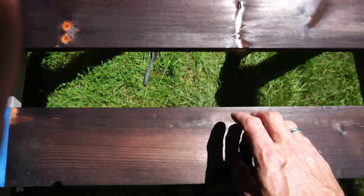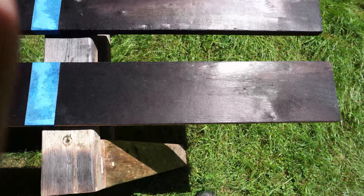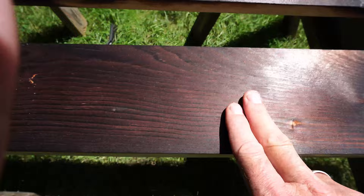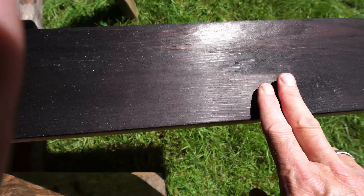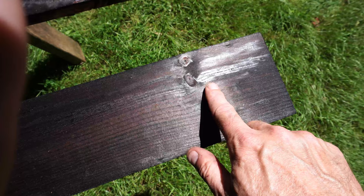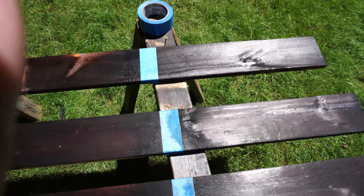The poly is down here — it's got a little bit more of a gloss to it. Moving all the way down to the heavily burnt end: what I don't like about these is it's so dark that you lose some of the grain of the wood that you still have over here — I think that's a really nice feature. But that said, if you're going for siding or something to that effect, I would go pretty dark and burn it heavily. Some of the Danish oil didn't quite soak in there, and the polyurethane is a little shinier. I'd probably hit the polyurethane one more time to see if that does anything. You could add more linseed and Danish oil here as well.